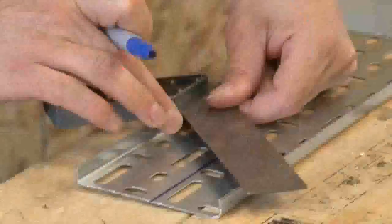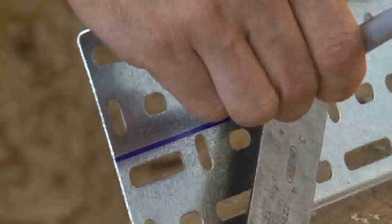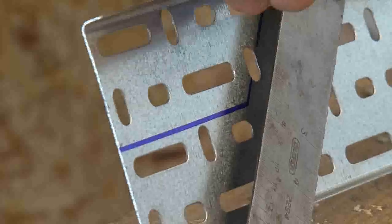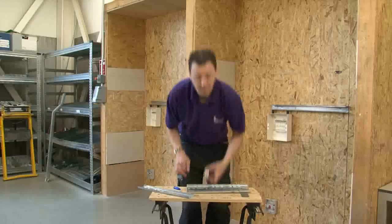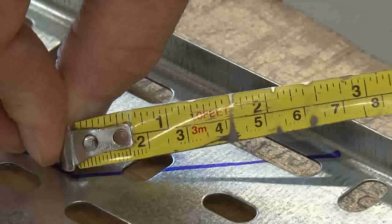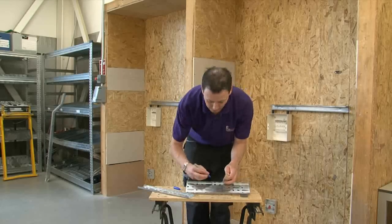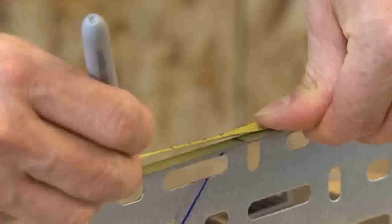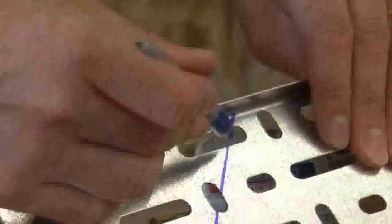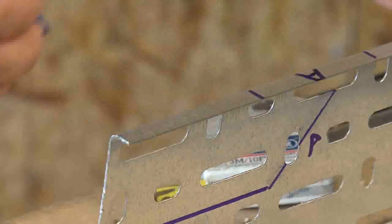Place the square on and get it so that the actual tray lines up with the mark. Then out comes the tape measure — measure that gap. I've got the measurement at 70mm. Working from the top, I'm going to mark 70mm going back towards the opening. We call this distance A, and it has to be the same on both sides — I mark both as A.